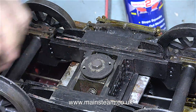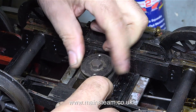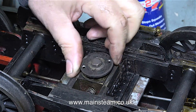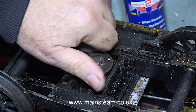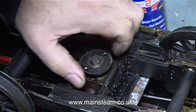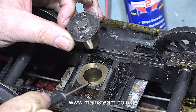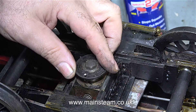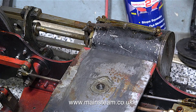Anyway, back to the job — I'm removing the front bogie. This front bogie is held to the chassis in a very strange way. The nut, which is quite badly chewed up (and this is not my doing), does not rotate freely in the disc that I'm undoing. And in the main bearing are two sheared-off bolts, which were originally countersunk bolts that held this to the main bearing. If that's the case, how can the front bogie swivel? This is a very strange arrangement — I'll have a look at it later.